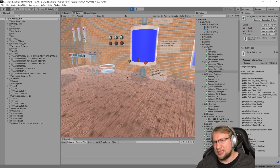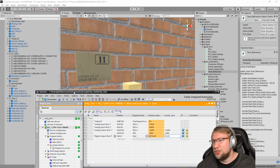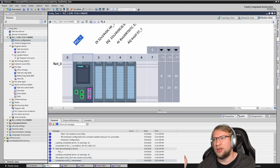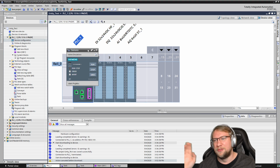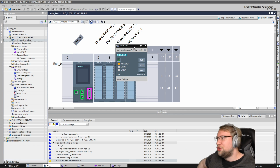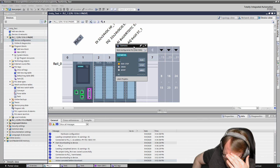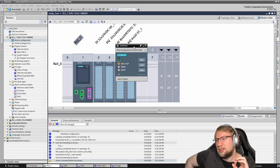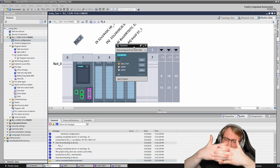The main problem with this is that Siemens... Can I complain about Siemens right now? The new Siemens generation for the S7-1500, if I go to my simulation tool, like PLC Sim, I've made a video about it, the new version does not support some kind of S7 communication. That is pretty annoying. If it would just be the S7-300s, there's no problem. It is so easy to communicate to a 300. So easy. For a 1500, you need in between this stupid tool.